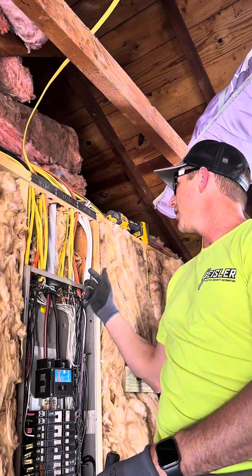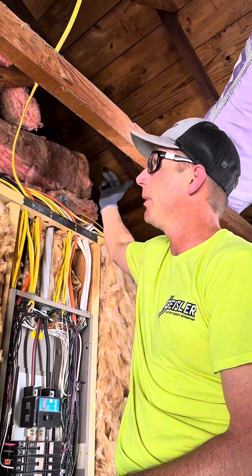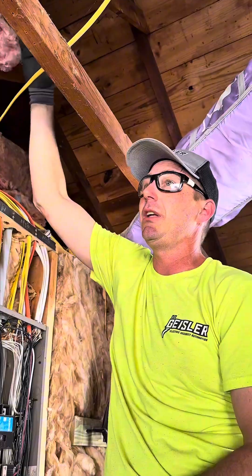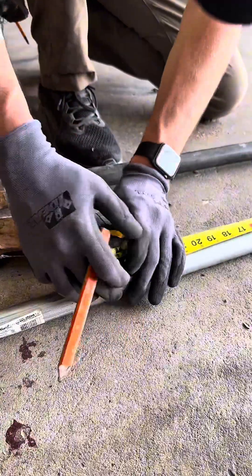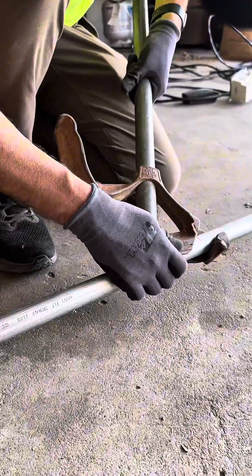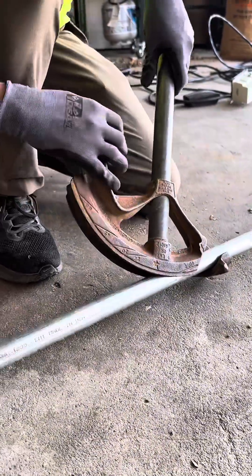Now all I've got to do is figure out this distance. I may have to offset it a little bit, come up and then just 90 straight over. I'll put braces in between probably after I get done. One inch EMT — you've got to deduct eight inches. So 22 minus eight would be 14. I'm just going to line that arrow up with that mark and bend this to 90 degrees.